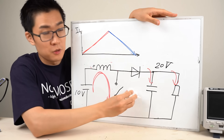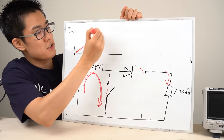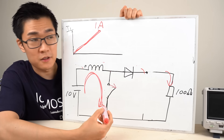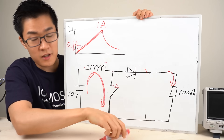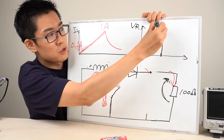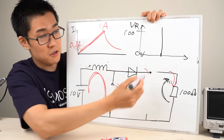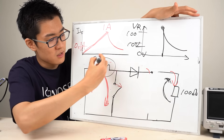Let's try an interesting thought experiment: what would happen if we removed the capacitor? If we close the switch and allow 1 amp to flow through the inductor, then open the switch, the circuit becomes a simple RL series circuit and the current starts to decrease. The voltage rises quite high — when the switch opens, the voltage across the 100 ohm resistor suddenly rises to 100 volts because 1 amp is flowing through it, where originally there was just 10 volts. The voltage then decreases rapidly and eventually settles at 10 volts. That's how the inductor stores enough energy to boost the voltage.